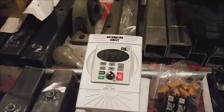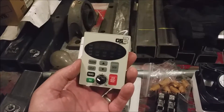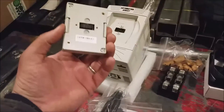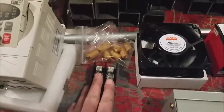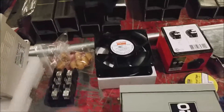My goodies for the mill came in. Here is my GS2 drive unit — my VFD. This little control panel mounts up on my mill, while the main VFD drive will mount in my trusty blue box on the floor. I've got a cord for it because it needs a cord when separated. This is a DIN rail adapter for the VFD so I can mount it in that panel. I bought the fuse kit, fuses, some extra fuses — those things are expensive. I also bought a fan so it will go in the blue box to keep things cool in the summer.